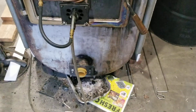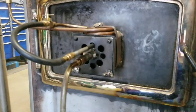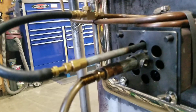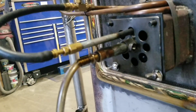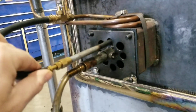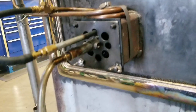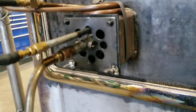I can just plug that right off when it's running on oil. In the front here, that's the burner plate or the injector plate — just welded a tube in there. There's a couple pieces of copper fittings shielded with steel tubing. The upper one is the oil intake, the lower is the air, and they go to an injector nozzle. I can also adjust my flame front by simply sliding this nozzle in and out. Just two wing nuts and the whole assembly comes out for cleaning.